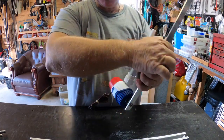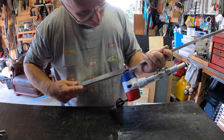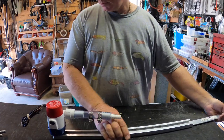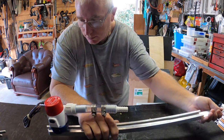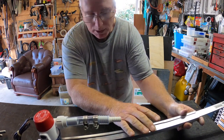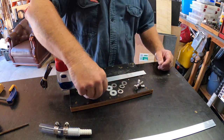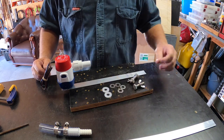So this slides into the box. The flat will be cut to length. The box will be attached to the boat and then it's as easy as using the bolts to secure it. There'll be a wing nut up here to slide it up and down to the right height and then lock it off. This is what I'm going to use for the adjustment - a couple of bolts with wing nuts, stainless steel washers and a couple of nylon washers.